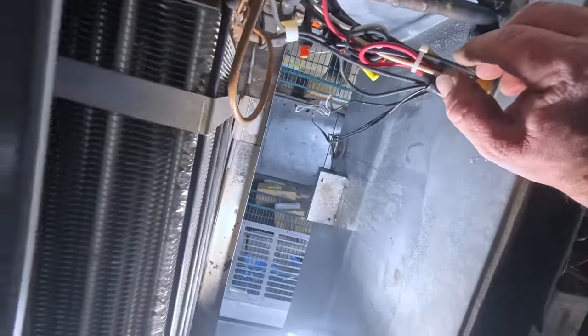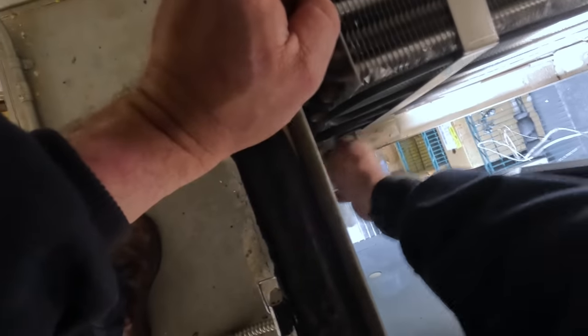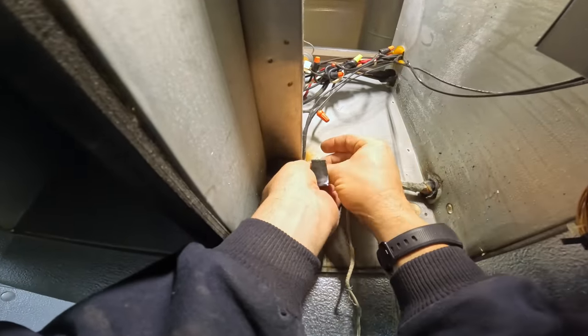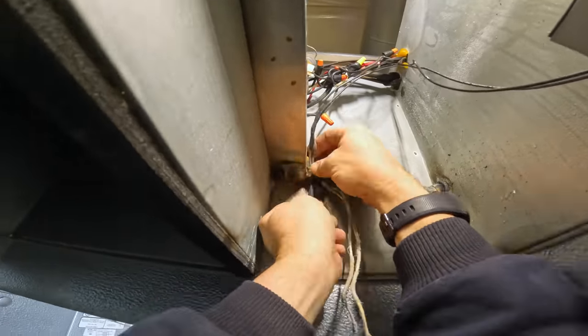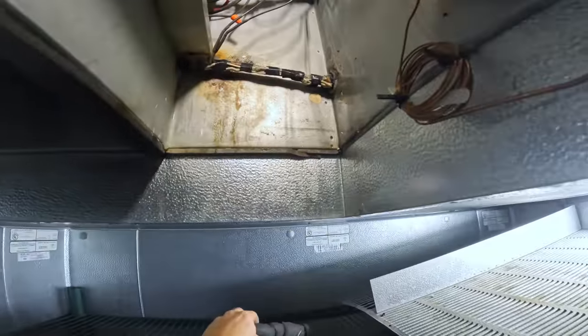Things that are super hard can literally break because they're too hard. I want to make sure I get all residual crap out of this drain pan, because the next problem would be the drain line gets plugged up because of some residual crud in there. So we've got that pretty clean. What they did last time was just put the heat tape right there — we'll copy what they did before and make it work again. Just trying to wrap tape around something that literally has less than a half inch of room between the wall — that is a little difficult. We now have it taped up good enough that we can wrap the foam back around it.